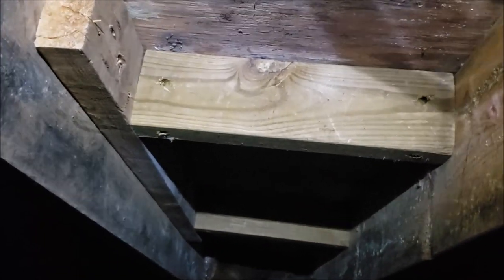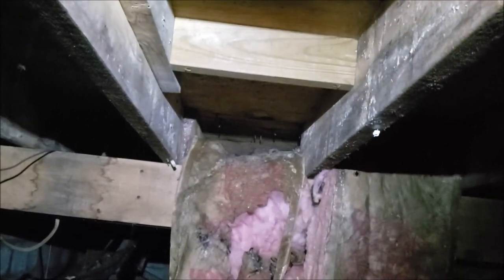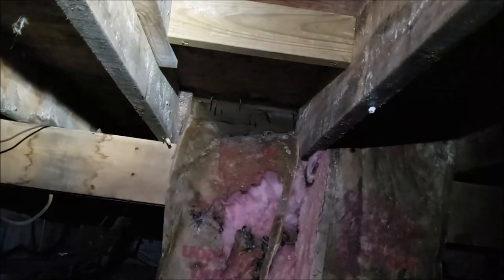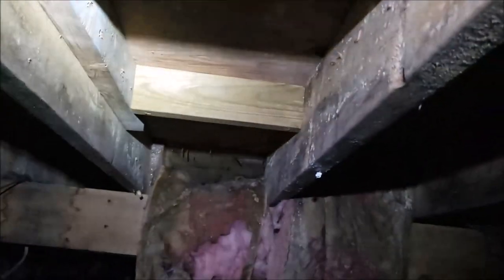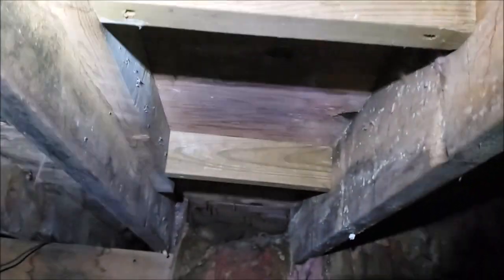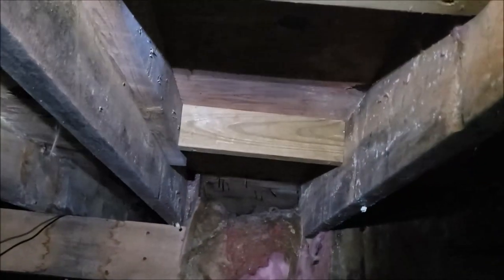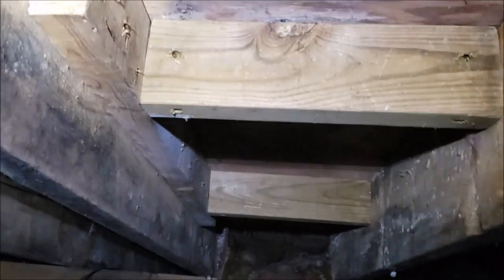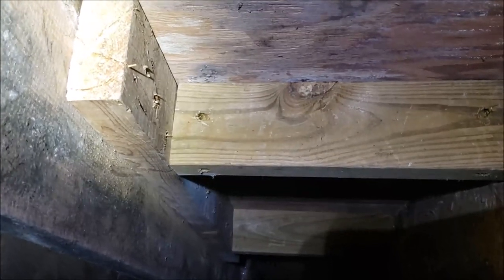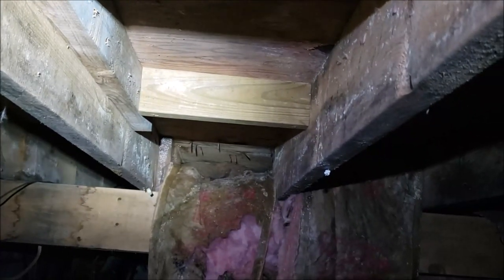As you can see, that's the final result. It didn't take too long — got the soft spot removed. I had the tenant walk on top of it while I was under here just to make sure everything was good. So just in case you've got a soft spot in your floor, crawl in there, take a look at it, do a little scabbing, put some screws to it, and take care of the problem. Thanks for watching, have a great night.